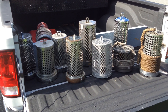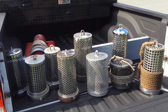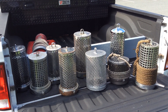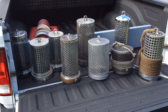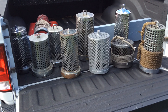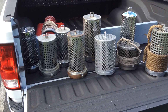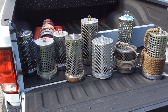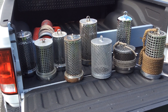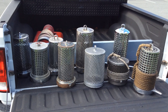We thought we'd take a minute to talk about suction hose strainers. We're getting ready to do some performance tests on various suction hose strainers — barrels, low levels, floating, some basket strainers — and that's going to happen at the end of September. But we thought we'd give a little sneak preview of our discussion about strainers. Short of the red one in the back, you're basically looking at barrel strainers that'll fit a six-inch hard sleeve. None of them are the same; we can only suspect they will each have their own individual flow capability. We do know that in most instances the barrel strainer is one of the top performing strainers when drafting with your pumper.